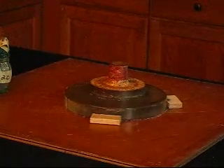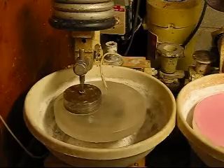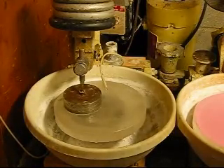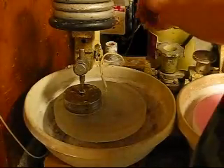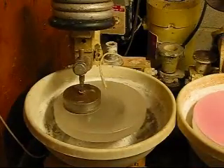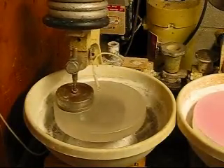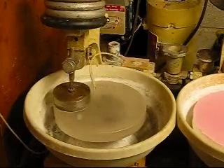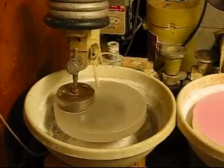That's the process. An easier way to do it if you have access to a polishing machine — I've got this diamond wheel that I showed you earlier set up on a spindle with water dripping on it, and I'll let the machine do all the work. Here's how it runs. It's pretty noisy. You notice that the stroke is long enough that the wheel goes to the edge and goes to the center, so the wheel is slightly smaller than half. And that's okay — this will generate the curve. A much easier way to do it.